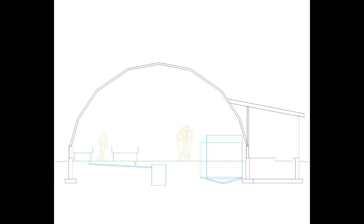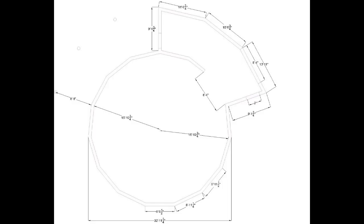This is a side profile of the geodesic dome. It sits on a required four-foot frost wall and will have a shed on the north side that will house a wood furnace. This also shows roughly how the grow beds will be set up. The foundation plan shows the 33-foot dome, the shed area, and the post footings for an open-air shed roof which will be used for wood storage.